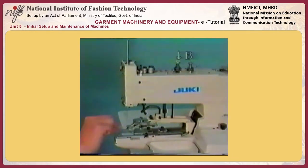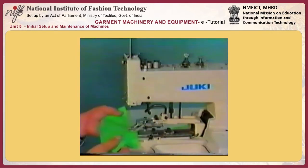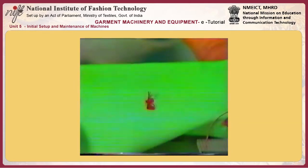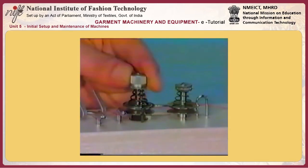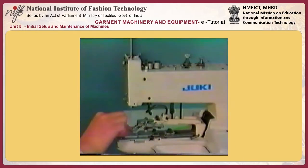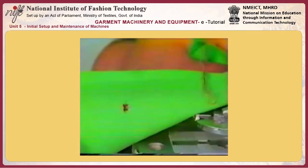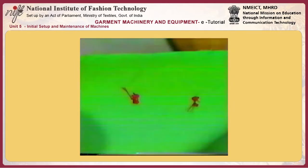Number 2, tension controller B functions to control the tension applied to the thread sewn on the wrong side of the material. If it is lower, increase the spring pressure. The tension controlled by the tension controller number 2 should be higher than the tension controlled by the tension controller number 1, and it changes in accordance with the thread, material, and thickness of buttons to be used. If the thread tension is insufficient, increase the spring pressure properly.